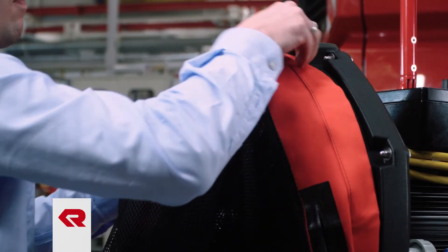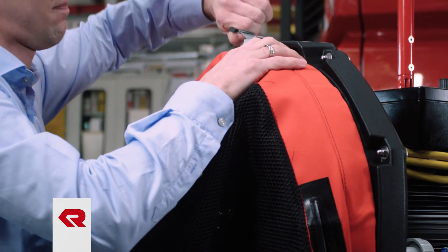And finally, here are a few tips on what to watch out for when using a Fan AG. Create an opening through which the foam is discharged and place the Fan AG as close as possible to it. Also ensure an exhaust air opening — although the Fan AG is being used as an expansion foam generator and not as a fan, an exhaust air opening is still required.